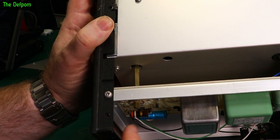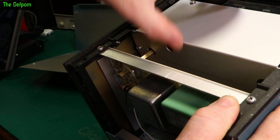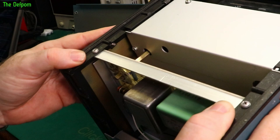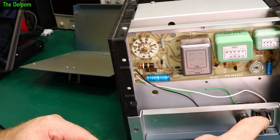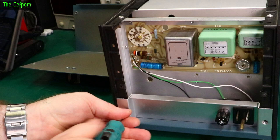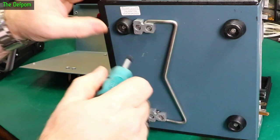I think we can look at doing the power supply switch-over first and look at changing this socket — it looks like I can just unplug that one and take it out. I do love the modularity of Fluke stuff from this era, it's all modular. We'll have to take the bottom panel off to get it out, which means breaking the calibration seal. So be it.